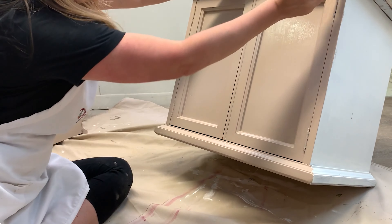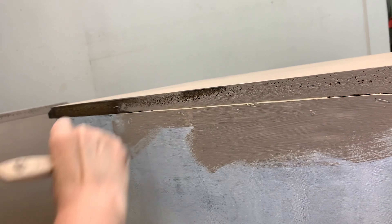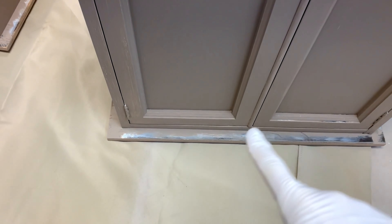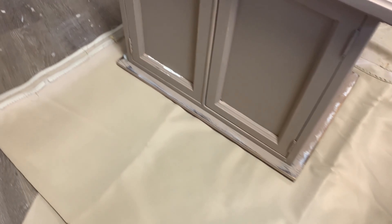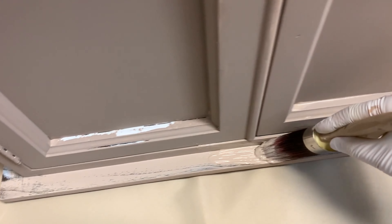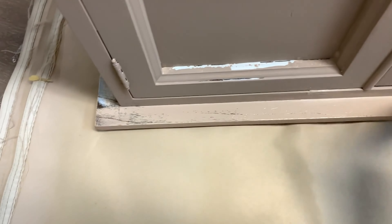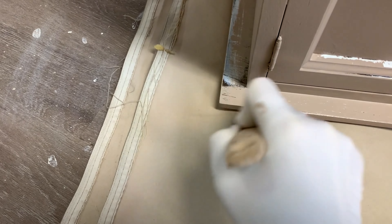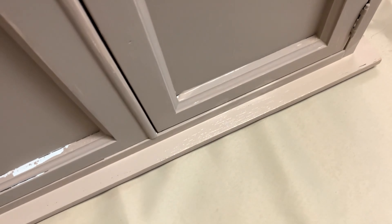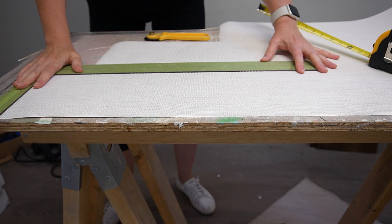I don't apply too much pressure, I just let the blade do its thing. For this makeover it was really great because I had the ledge for the blade to sit on. If you don't have a ledge, it's good to put your hand on something level so you keep that blade perpendicular to the project, because if you want a nice straight line it's good if your hand and blade are level. These oscillating tools are fabulous — they cut through plastic, wood, and metal, and have sanding attachments too. Just make sure you don't rush it because pushing and pulling the tool will dull your blades very fast. Once everything was cut through, the furniture mallet just breezed through and the bases came off super easy.